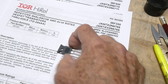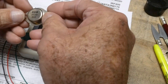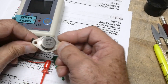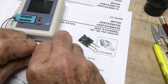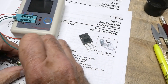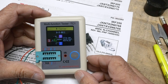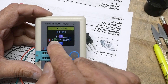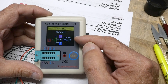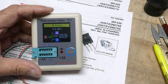Let's see if these things work. I'll get up my little tester here. This is the IRF350. Let's go ahead and hook it up. There you go — it even draws a little diode and everything real nice. It says turned on at 3.8 volts, 0.6 ohms on-resistance. There you go.